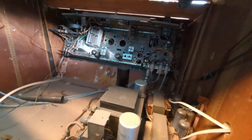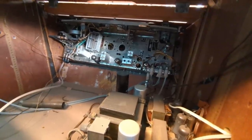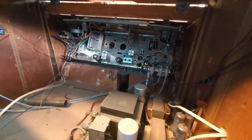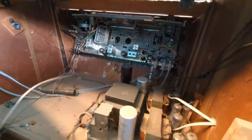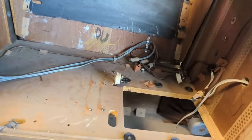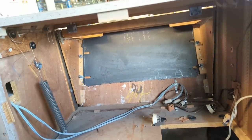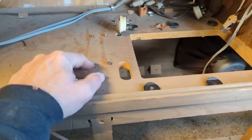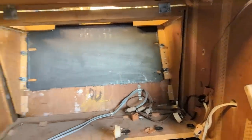To remove the tuner there are bolts on either side and a retainer screw. I'll swing this out so you can see. It's wise to mark everything because sometimes it's not obvious how it's put together. Be careful — there are a lot of fragile things you can break easily. I've extracted both chassis. Mark all plugs, and what I also do with these consoles that have 10,000 different sizes of hardware is put the hardware back in its place when I remove things, so reassembly is straightforward.